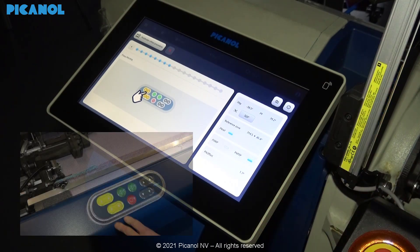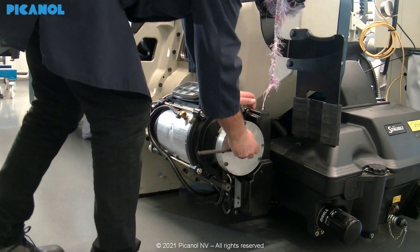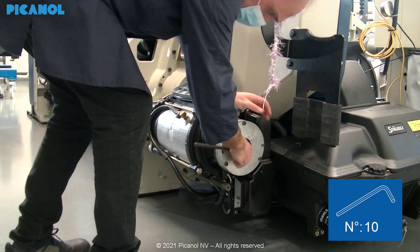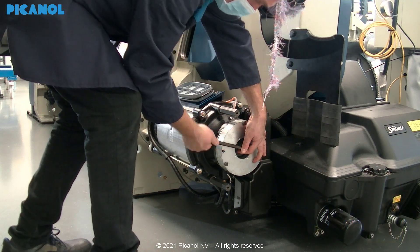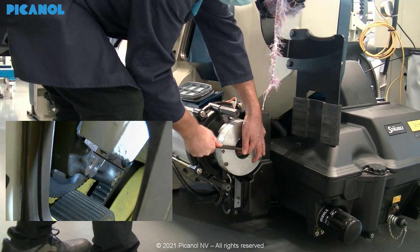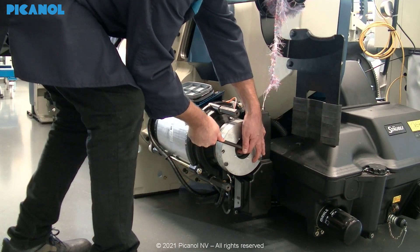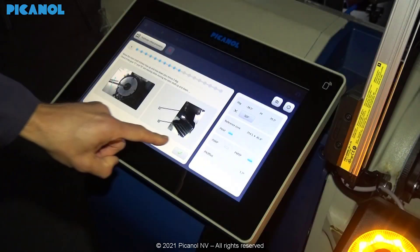Press Next and Pick Finding. Move the rotor shaft minimum 4 times max up and down. The movement is about plus minus 3 degrees. Check if the gears are moving when moving the rotor shaft up and down.